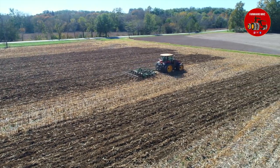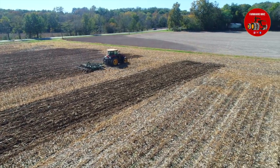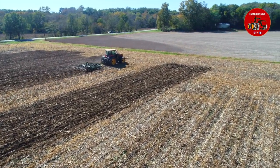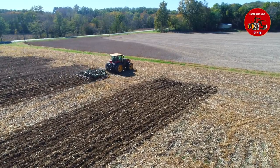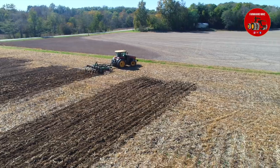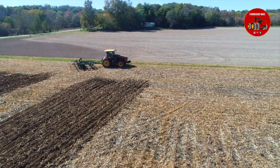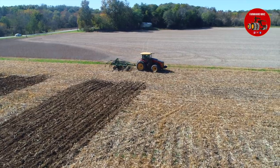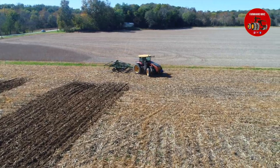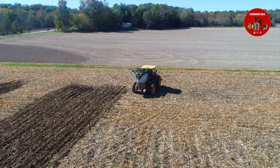All model tractors are Tier 4 Final diesel engines powered by the Cummins 8.9 liter. The only big difference is the 335 and the 365 do have a bigger transmission and rear end, and these tractors are about four inches longer than the 265 through the 315. So it's not just a horsepower setting on the engine — it is for the 265 through the 315, but the 335 and 365 are bigger behind the motor.